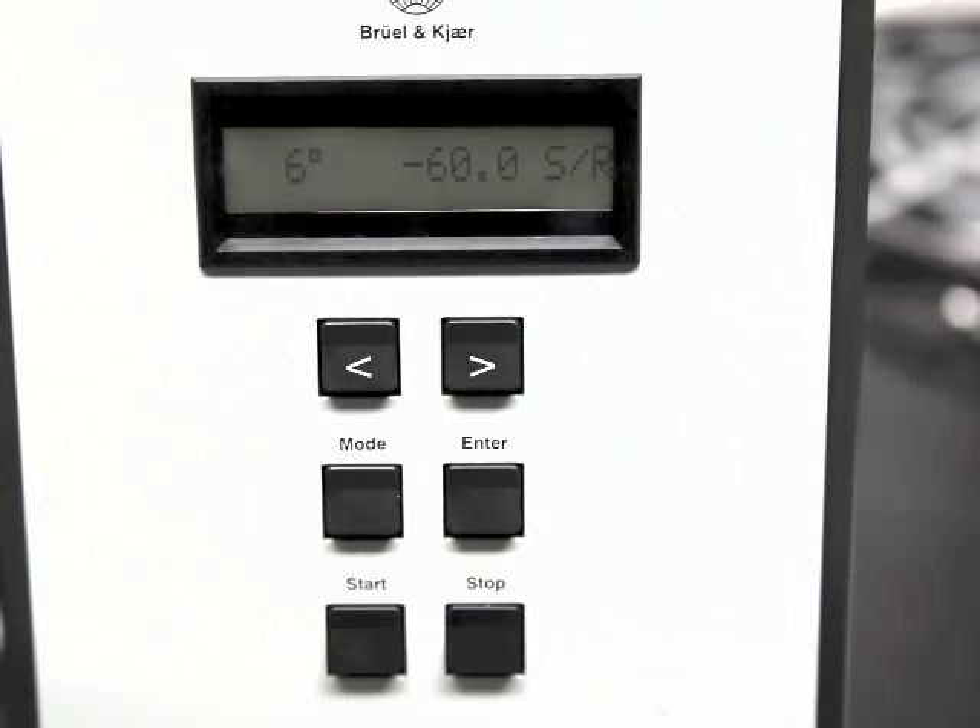Also, the reason I'm starting with the speaker facing away from the microphone is that I want the point at which the speaker is facing the microphone to be at 180 degrees, or at the middle of my data, so that I'm not making a splice on the polar plot right where my data is most interesting.